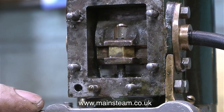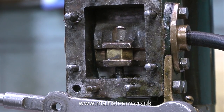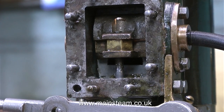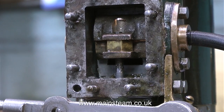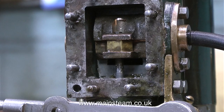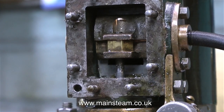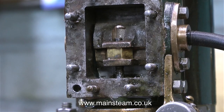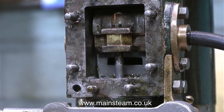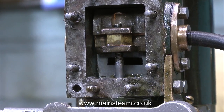Then I put the engine into reverse gear and rotate the engine in the opposite direction to see what happens with the valve. As you can see, the lever's moving as well which doesn't help — you have to approximate it and eventually you will get it right. I've come to the conclusion that the valve is slightly too high. So if you watch the thread sticking out of the top of the valve as I rotate the valve fork — which was two turns — it's now sticking up a little bit more, so now the valve is lower relative to the expansion link. This time when I rotate the crankshaft, the valve is more even over both of the ports.